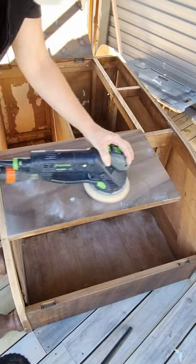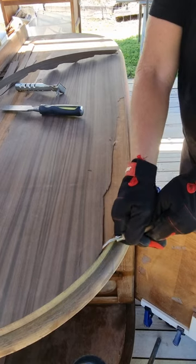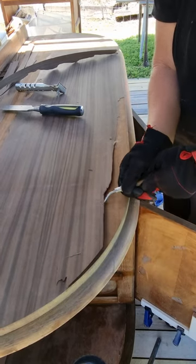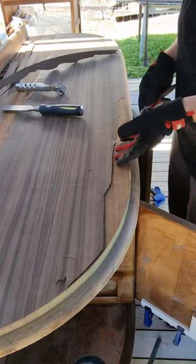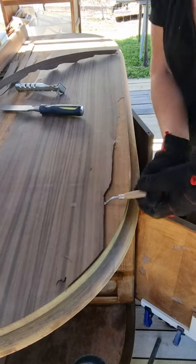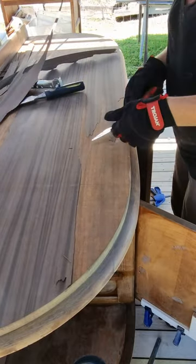I went to seal the veneer and unfortunately it was bubbling everywhere. I just slipped my palette knife under and ran it along and it just lifted. About 60% of it came up pretty easily, but the rest of it was stuck. Rather than go the iron and the towel method, I just went in with 80 grit on my orbital sander and sanded straight through it.